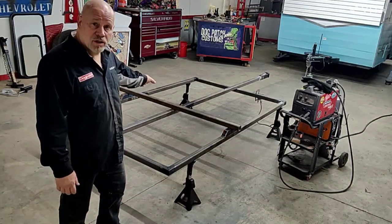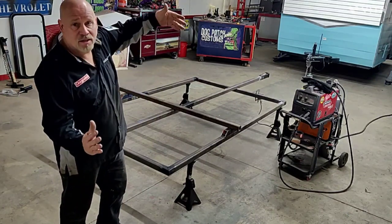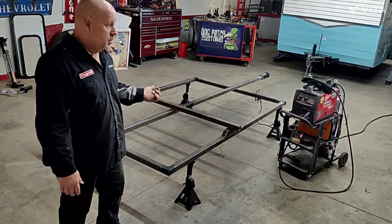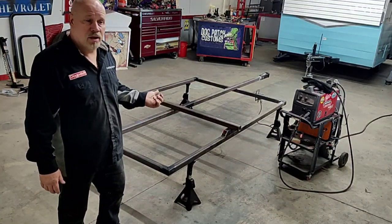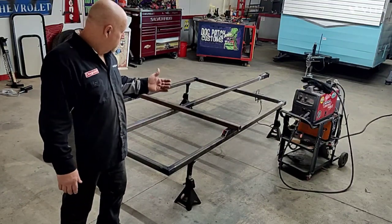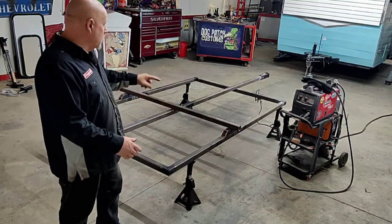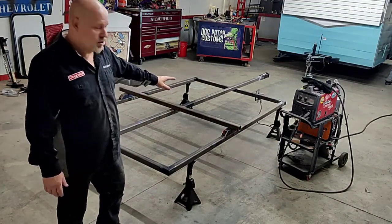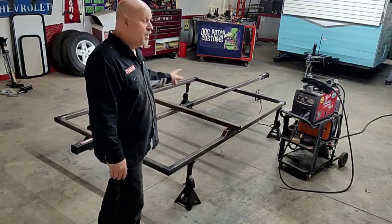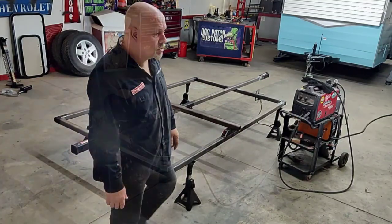It doesn't really give you much more ground clearance, maybe 2 or 3 inches, but it gives you that independent articulation when you're going through rocks or if you're going to go off-road with this thing. This thing's going to sit up high with them tires anyway. It's going to be a little different than a conventional leaf spring axle, solid axle, or square plate like I did my last torsion arms. Stay tuned. I'm going to put some gussets in here and there, and I'm going to weld that axle in place and get the stubs bolted on with some new U-bolts.